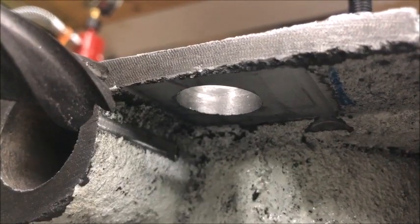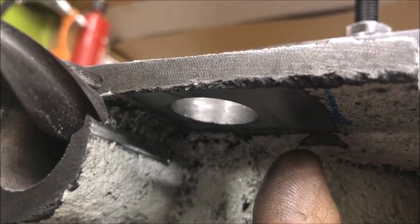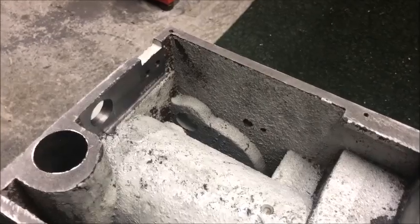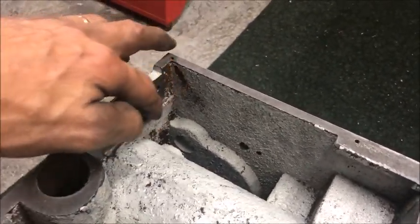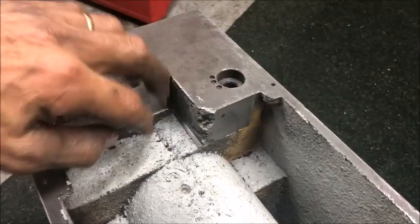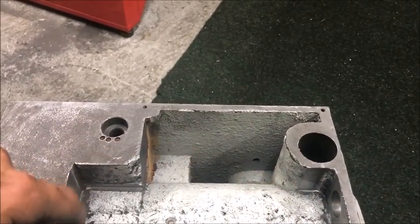And that was all that was needed to have a flat there. I made a miss there, as you see — I don't think it's necessary to mill that far in, but I just withdrew the moving cutter. I ended up taking a little bit more, so I extended the flat area over here, and also the backside, in case one should make something that would go all the way through and bolt down here as well.